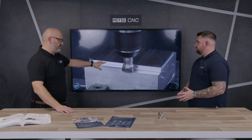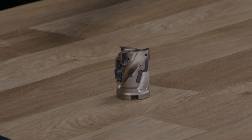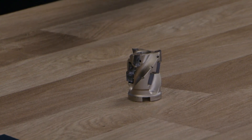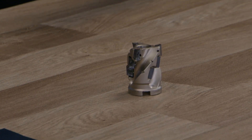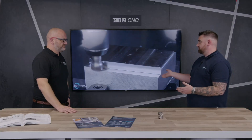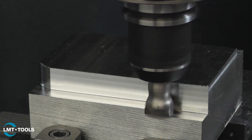What we're seeing on screen is roughly a four-inch depth of cut. You could do that in one pass — even if you have to reduce your AE step-over, your maximum AE is probably around 66% of the cutter. What the standard 90-degree shoulder mill does in four passes, this long edge cutter can do in one pass.